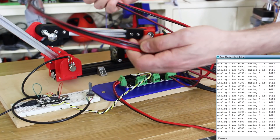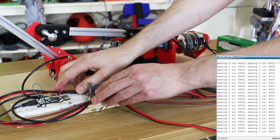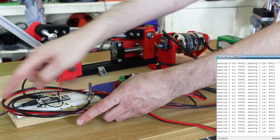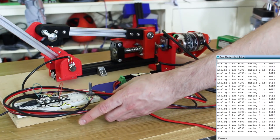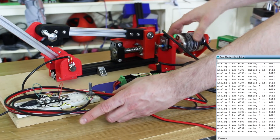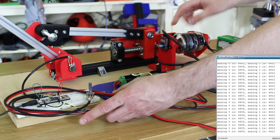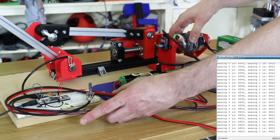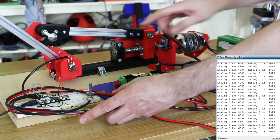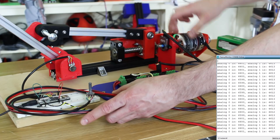As a proper test, I'm going to get the actual three-phase motor wires and wrap them around the analog cable so they follow almost the same path. If the cable were unscreened, I'd expect that to induce massive spikes just from the motor holding with three-phase power, and even bigger spikes as it drives more current trying to hold position. But that looks pretty good — I'm quite happy with that. We've still got a tiny bit of jitter, and with a longer cable we might get more, but that seems not too bad for having screened cable.